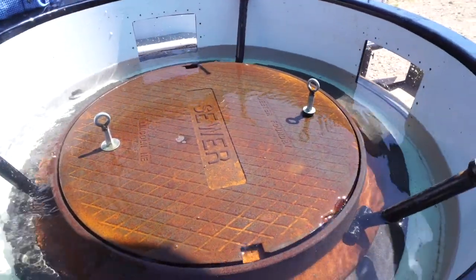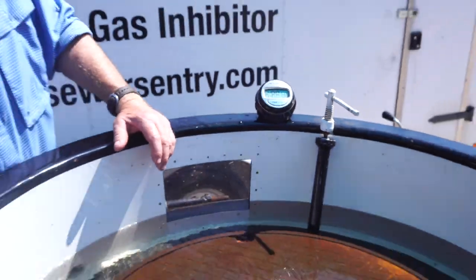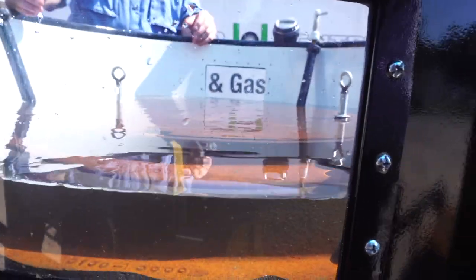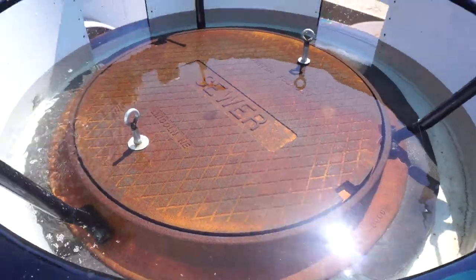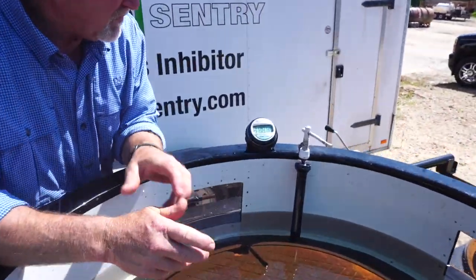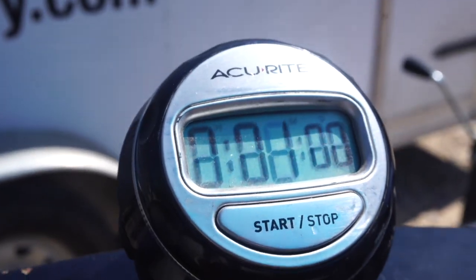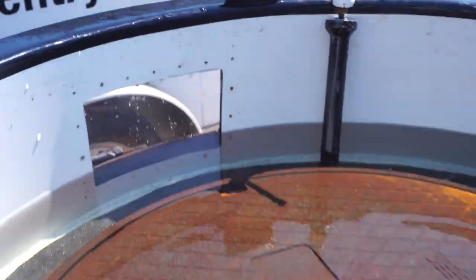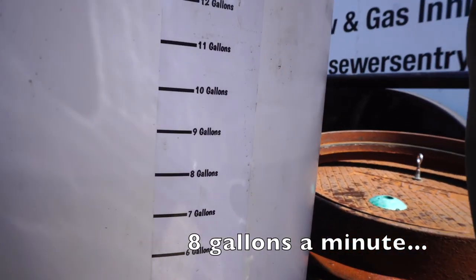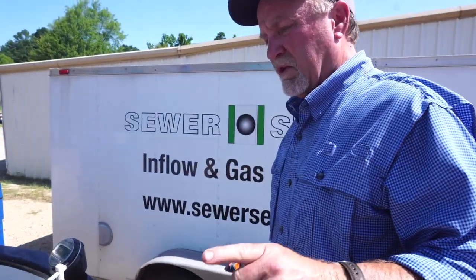in your streets. Start. You got the bucket under it? Starting now. Go. 1 minute. It's just a sheet of water, just like you have in the streets. Okay, time? 5, 4, 3. Eight gallons a minute. Okay? And that's one manhole. No pickholes. We're gonna show you what pickholes get here in a minute.